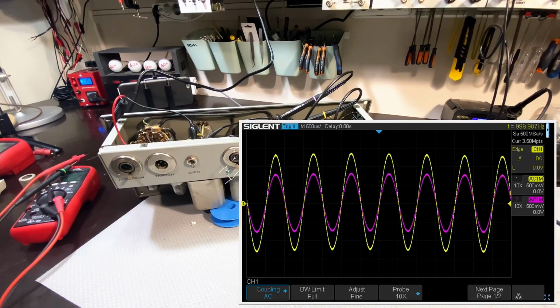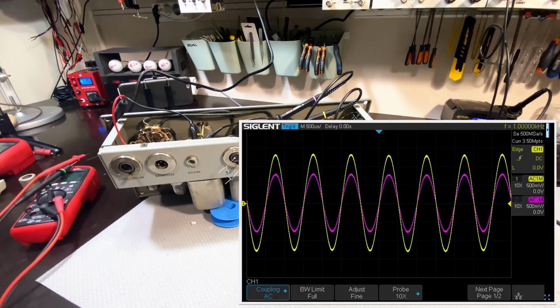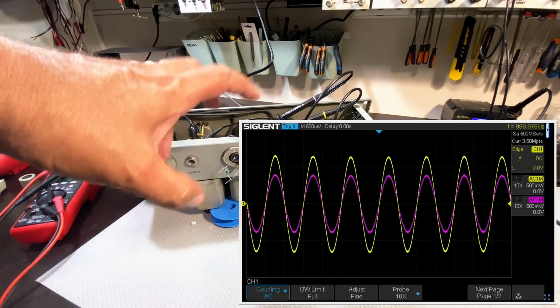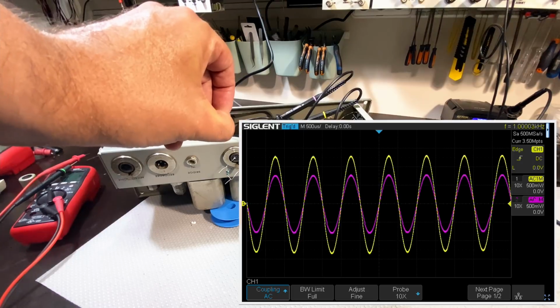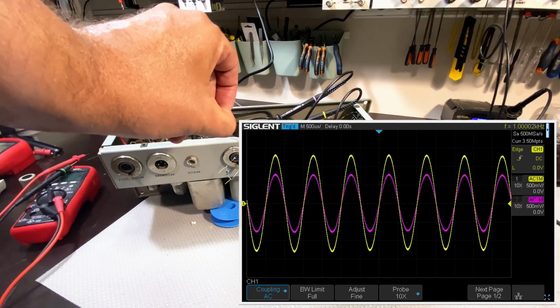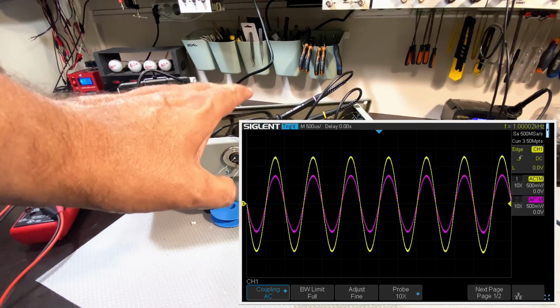I think what happens here is, why would you take this signal and pass it through a balanced attenuator? First of all, they probably didn't do that. I think this was done by that attenuator that was added on there. Whoever did this mistakenly considered that a balanced signal, and it's not. It's referenced to ground. The transformer has one leg of the secondary connected to ground, so it's not a balanced signal. They should actually have used a single-ended T-pad attenuator, not an H-pad. It's not an H-pad if it's single-ended, but never mind. They should have used a single-ended attenuator.